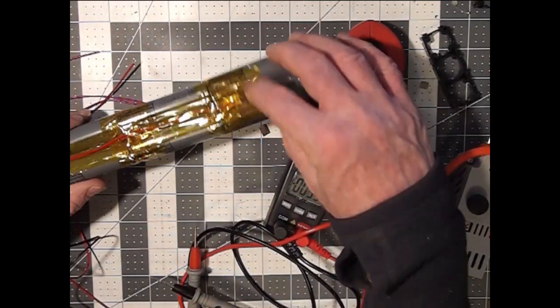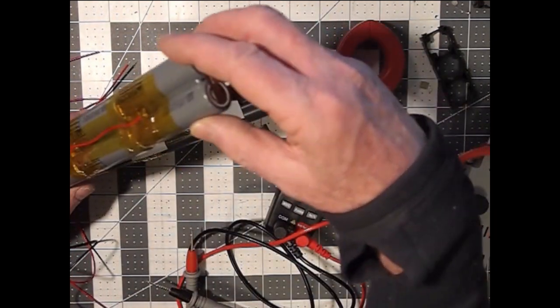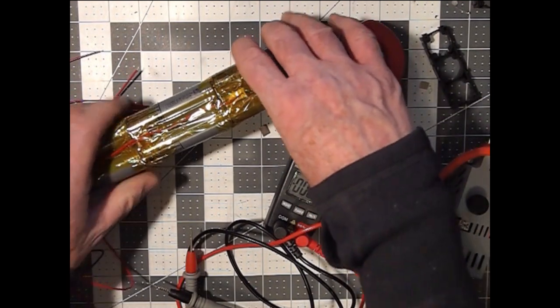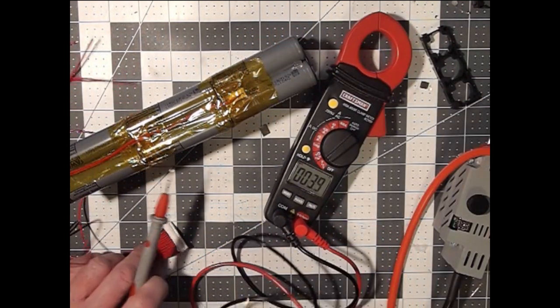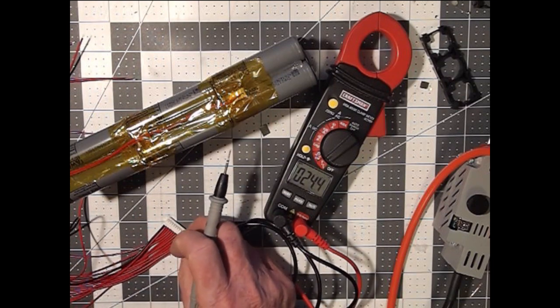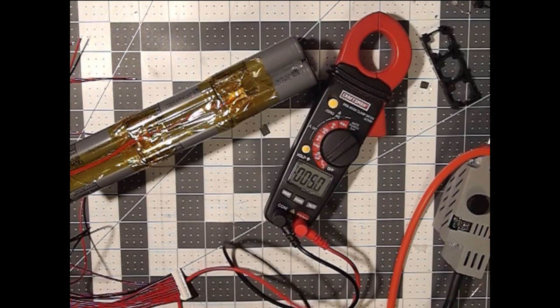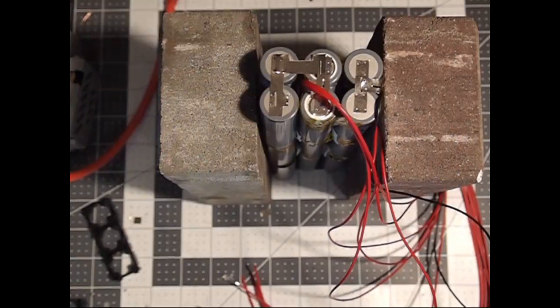After I've added my Kapton tape and run my sensor leads and connected them, just before I fasten that top layer down, it's not a bad idea to do a one by one test on your flat wire leads.